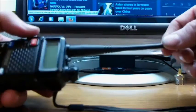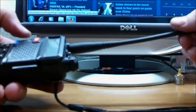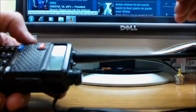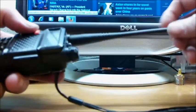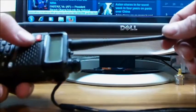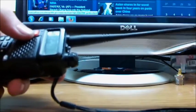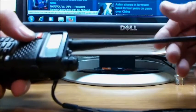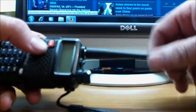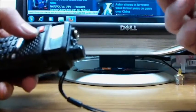The main purpose of this video is to show you some options that you can use for antennas. This rubber ducky antenna is basically good enough to get you about two to three miles, five miles at the max if you've got good line-of-sight with almost no obstructions in between you. But that's what the radio comes with, and it's not much — it's what we call the rubber ducky.